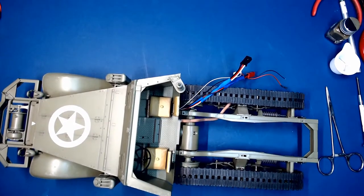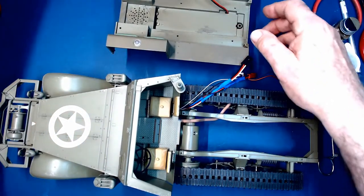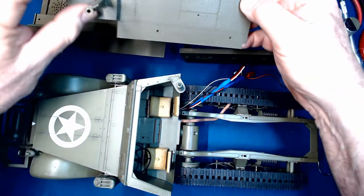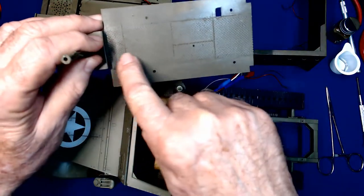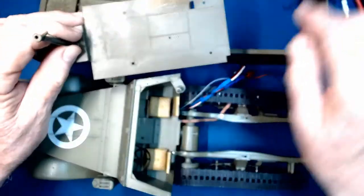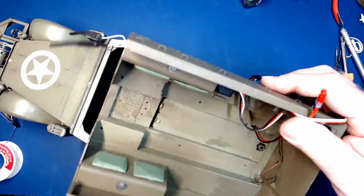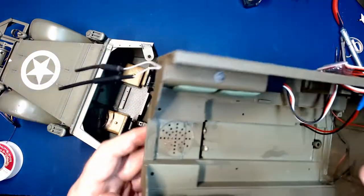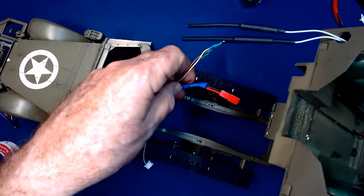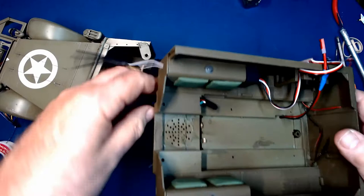What we've got here is the basic front body and frame, the rear compartment flooring and sidewall gas tanks, the outer wall, and the new flooring. I've got a diamond plate effect simulated by using some screening — I cut the shape, cemented it down, then took some Tamiya putty and smoothed it in. It shrinks a little bit so I smoothed it in, let it shrink, and then painted it. I put the rear body on the bottom part and we're going to pull the wires for the motor and the steering servo.